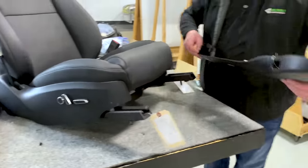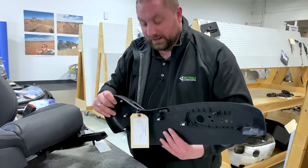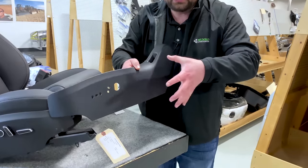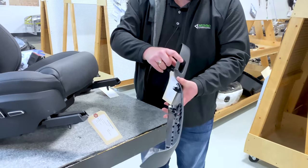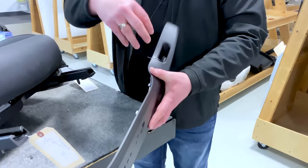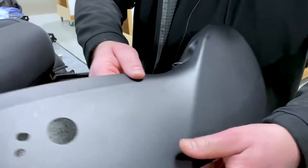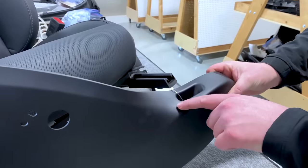Now in the side shield, they have a pass through for the belt. This is a little odd. When you're injection molding this part, you have the main tool that is opening this way. You have the core of the tool coming out this way. But look at this belt pass through. That belt pass through is on a slide. It is moving in a different direction. In order for that to move on a slide, you have a parting line.